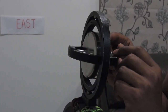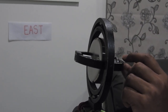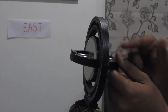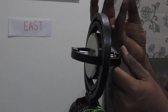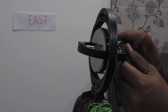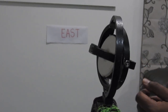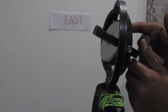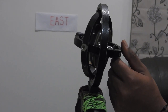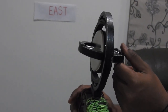The property of inertia means that if a gyroscope is made to point in a specific direction, it should keep pointing in that direction unless acted upon by a force. Think of it like a spinning top — it has a heavy center, and based on the mass it needs to attain a maximum RPM. That's the moment of inertia. Once the rotor attains its maximum RPM, if you make it point in one direction, it should continuously point that way.